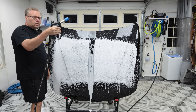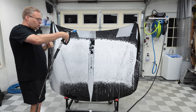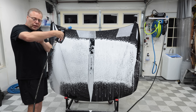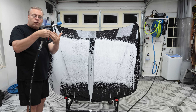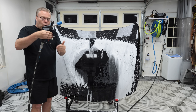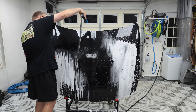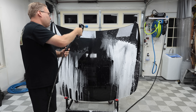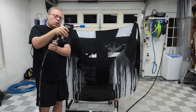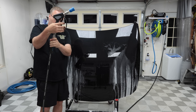Here's that spray angle difference — I'm holding the gun with my palm, ready to pull the trigger, but with the SGS-28 my nozzle is pointed straight at the ceiling. So I have to turn my wrist, and when I do, I now feel the weight of the hose pulling at my forearm a little bit as I turn — which is uncomfortable while the trigger is pulled. When I'm up high, I have to turn even more to get that downward angle. What I do is adjust my hand position toward the bottom, gripping in a smaller area — it really helps.